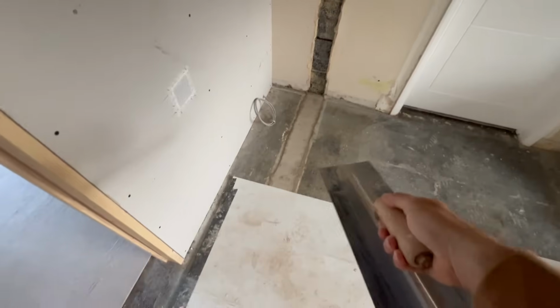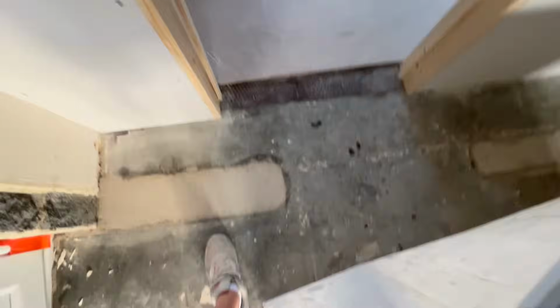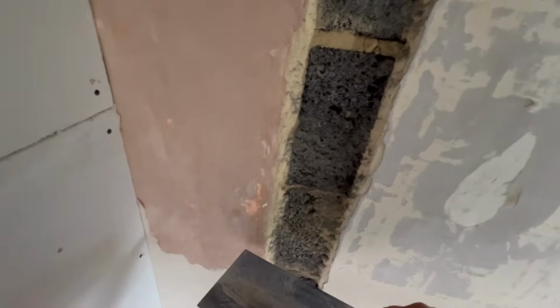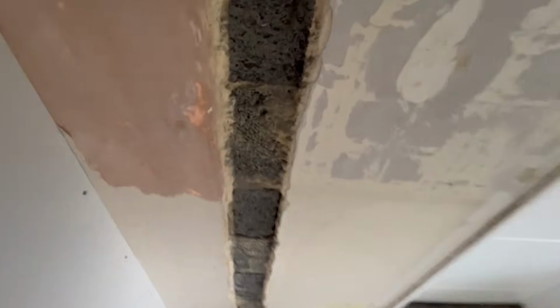So for whatever reason, look, you can see on the floor, the ceiling's been retacked, so there's no sign that that used to be a wall there, but you know, let's have a look here. So that was where the old wall was, yeah? So they've moved it back a little bit. Now, when you've got a chase such as this, where this used to be two different rooms, it's very unlikely that these two levels are going to level up very nicely at all. And they tend to be, because if there was a wall there, you tend to come out this way. So they would come out this way, so these walls would be curling around to that internal.